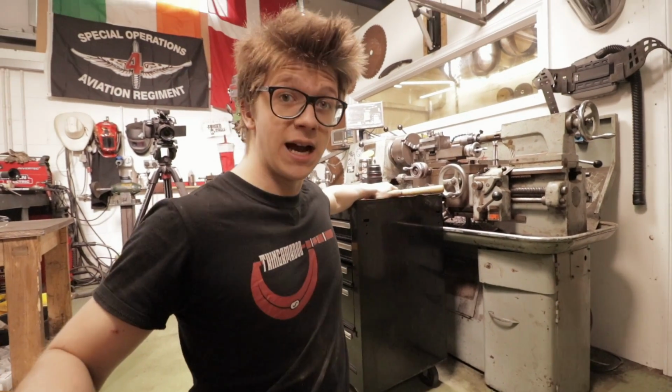Ash is still a great handle material. And what ash will be giving you is a little extra whip in your handle. It's going to be giving you a little extra spring. It can feel a little easier in the hand than a hickory handle will, where you're going to get a slightly sharper reverberation. But really, it's a taste thing. Certainly with hammer handles, I prefer the hickory.